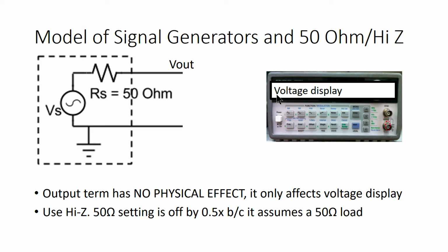And that answer is actually pretty involved, and I'm eager to tell you more about it in my RF class. But the quick answer is that old-timey radio cables had a 50 ohm characteristic impedance, which means that almost all high-speed equipment has an impedance of 50 ohms. As a result, old-timey function generators all operated in 50 ohm mode. Eventually someone realized this was confusing and they created high Z mode to try to combat the confusion, but that actually only made everything worse because now there are two competing standards.